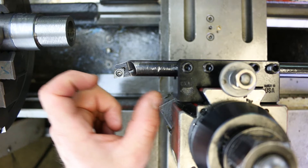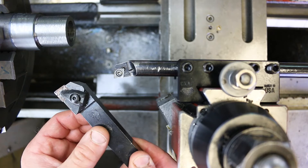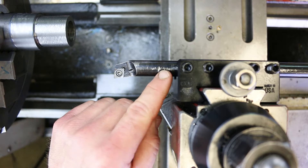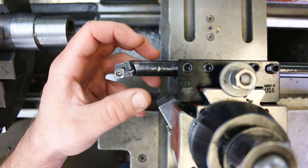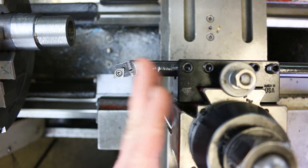You can move the insert from the boring bar straight to the other tool holder. When setting tool heights for a regular square tool holder, you just loosen the set screws, flip it around, adjust the height, and flip it back — it holds the same orientation. But because this is round and sitting in a V-groove, if you were to loosen it, flip it around, set the height, and come back, it's going to change its indexed position slightly and no longer be on center. So we need to swivel the entire tool post to get the cutting edge to line up with the live center so we can adjust its height.